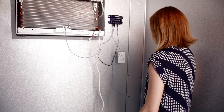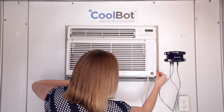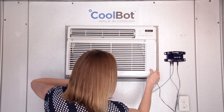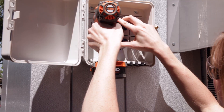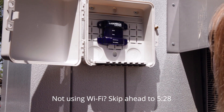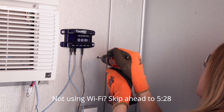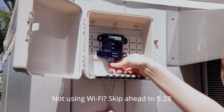If you choose to use your AC with the front cover, route the fin sensor and heater cables to avoid pinching them. The CoolBot jumper should be mounted outside of your cooler in an area with good Wi-Fi reception. Drill a hole through the cooler wall and route the gray data cable between the CoolBot Pro and CoolBot jumper.